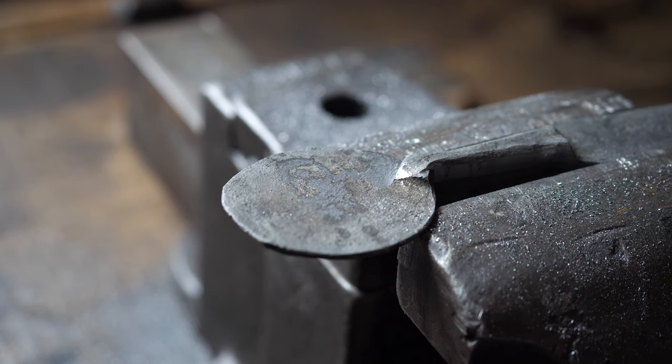As far as the bowl itself is concerned, I just got a cheap mixing bowl from a thrift store, and filled the bottom with some lead and then poured concrete over top. So the pitch really only covers about an inch. And it's still too big. I could have made this way smaller. And you also don't need to have it in a bowl at all. You could just have it on a plank of wood. You see a lot of Japanese metalsmiths just put it on a block of wood and clamp that in their vise, and that works great too.